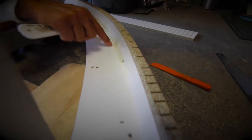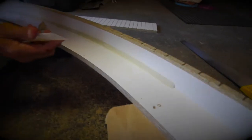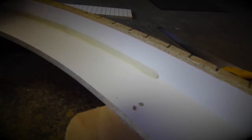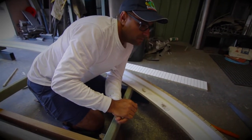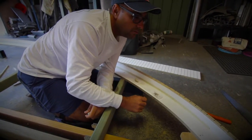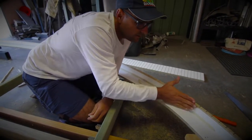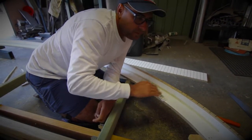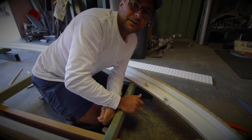Occasionally you might end up with a little bit of extra on each side that you can just scrape off. But this is just a one-off mould, so it's not going to be 100% perfect when we take it out of the mould — we're going to have to do a little bit of detailing to make our coving board look 100%, but that's not too hard. Any imperfections from the mould onto our coving board, it's just a matter of wet sanding, getting a nice smooth surface on your gel coat, because this will be filled with gel coat first, then fibreglass. That gel coat will allow us to sand it back, make it smooth, buff it up and polish it, and it should look a million bucks — well, that's the plan anyway.